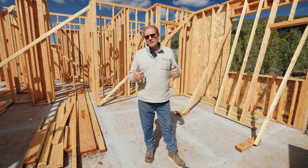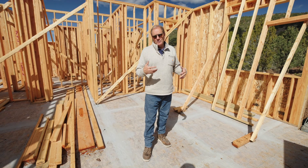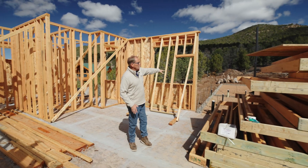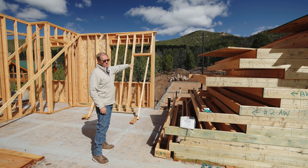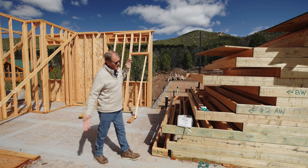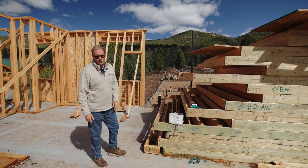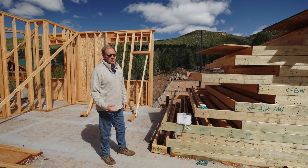This primer deck protects that and also gives me a little freedom from stress. If I can protect my substrate — which is my tongue-and-groove flooring — then I know I'm in a better situation. The framers couldn't really move any further because we are still working to pour that slab over there, this interior slab, and the garage. So they asked if they could go ahead and do a modular frame structure. They went ahead and framed everything ready to go. When we get that poured, they'll bring their crane up here, lift everything into place, and they'll move really, really quickly.